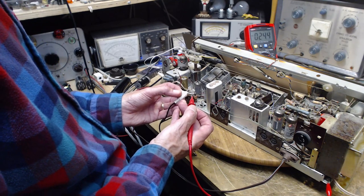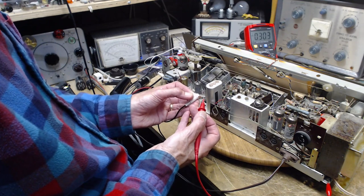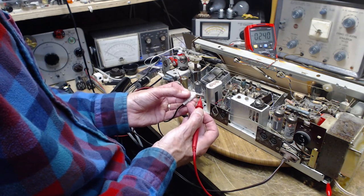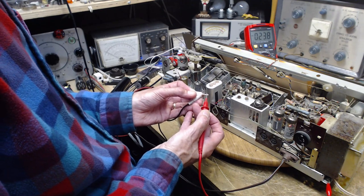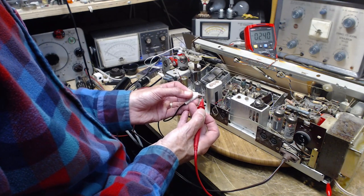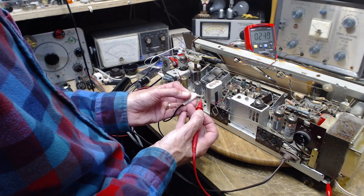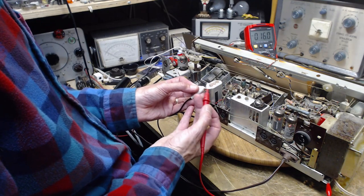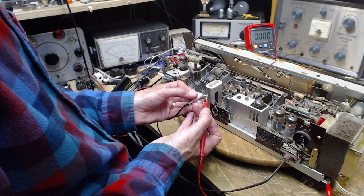So what's happening here is a charge is leaking, my assumption, a charge is leaking through a capacitor sufficient to drive that meter. That meter has an input impedance, probably 10 megohms or something like that. See, it's down to 23 volts and it stops there. That means the charge leakage rate is sufficiently high to place a potential of 24 volts under this circuit arrangement, which is the meter. The meter is the circuit. I take it off. Charge continues to build up in the capacitor, and now we bleed it off with the meter.